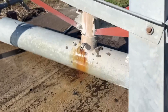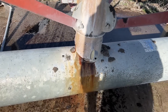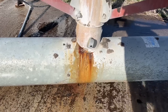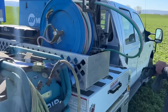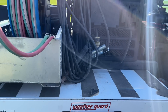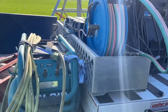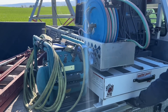We gotta grind it a little bit, put a jack on it and lift it up, then shove some boards underneath it. I'm gonna try to weld it up — the guy we usually have come weld isn't here. On our repair truck we have a stick welder, but that's thin metal and I'd just burn big holes. We also have a MIG spool gun, and we're gonna use that because it'll do a much better job than a stick welder on thin metal.